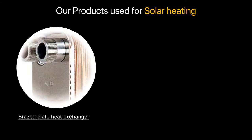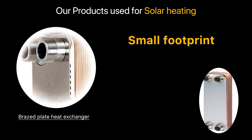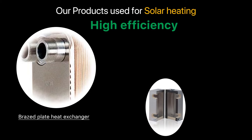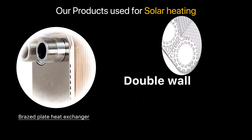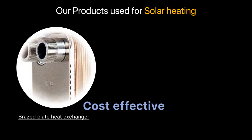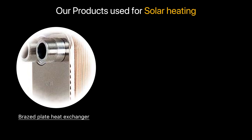The SafePak Brazed Plate Heat Exchanger is a standardized but very compact plate heat exchanger, which is very suitable for this kind of application. The high-efficient plates of the SafePak allow low LMTD values while still being very effective. The SafePak also has the possibility to choose a double-walled version, and this version is also standardized. Due to the standardization, the SafePak is not expensive compared to other kinds of heat exchangers. In this standard range, we have a copper-brazed unit and a stainless steel-brazed unit.